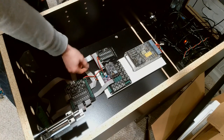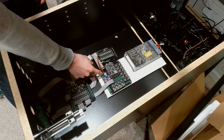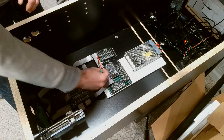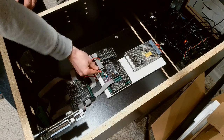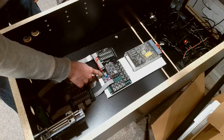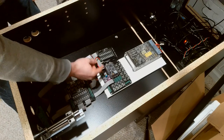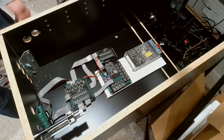You'll have another 12-volt power line that you can run to one of the expansion boards, and then a jumper line that you can run from either expansion board — the plus or minus here or the plus or minus there. While this could be used as an input to the motor, you can also use it as an out port. It's just an easy way to jumper power.